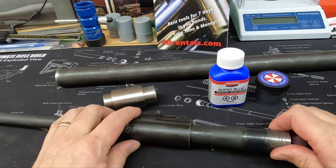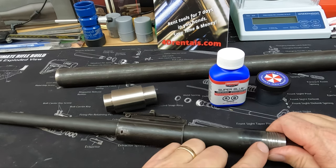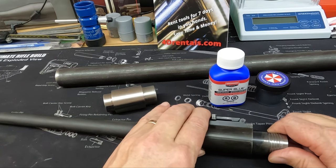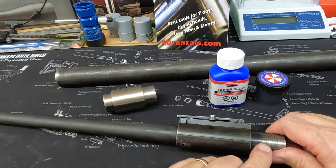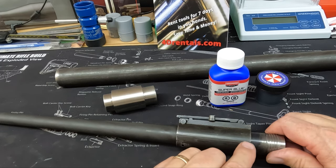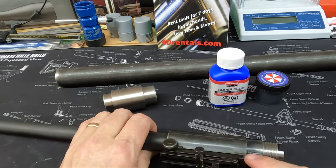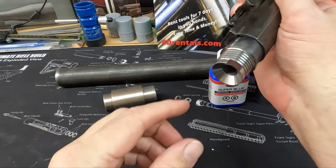Now, when we put this sight collar on, this is our timing mark that I mentioned for the action. You won't be able to see this timing mark, which is unfortunate, when you put the sight collar on, the way this thing is designed. Evidently, the bottom line of the sight collar lines up with that witness mark. So if you drive this on carefully, you can get this line in line with that, and you'll be on your mark. Now, the way I also check that is when this is driven forward, this area right here, I don't know if you can see that well or not,